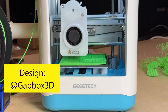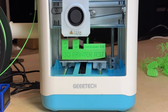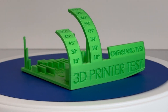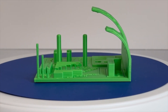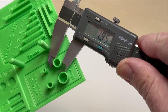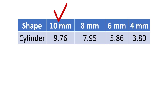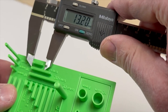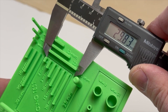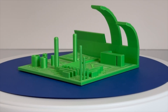Next, I printed a calibration test design by Gabox3D on Printables using the GTech green PLA. I used Orca Slicer to slice the part, and it took almost 6 hours to print. There was obvious warping or lifting from the build plate in the front right corner, but other than that the print turned out quite well. The overhang test was successful, printing all the way to 80 degrees. The cylinder diameters measured 9.76 mm, 7.95 mm, 5.86 mm, and 3.80 mm versus design diameters of 10 mm, 8 mm, 6 mm, and 4 mm, respectively. Rectangle lengths measured 9.94 mm, 19.83 mm, and 29.83 mm for design lengths of 10 mm, 20 mm, and 30 mm. Bridging looked great, and there were virtually no stringers.